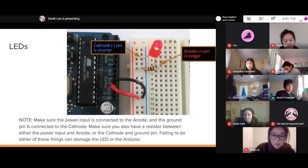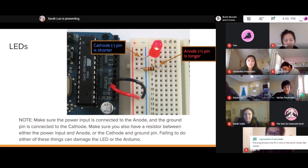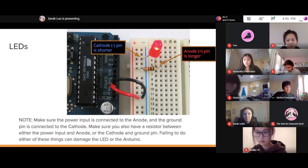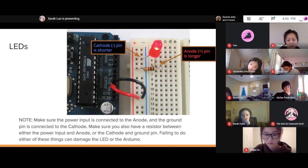And then the other end goes into a USB port on, say, your computer. And assuming you set up your circuit right, you'll have a nice shining LED. Mine is unusually bright, probably because this resistor is probably on the low side of safe, but it still should be safe.